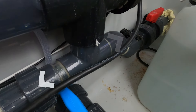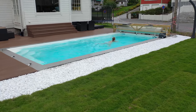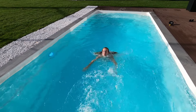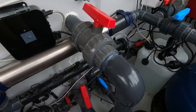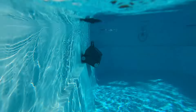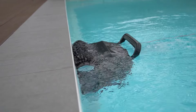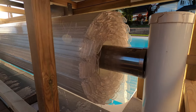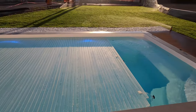After the water is treated, it is split into right and left sides — the right side goes to the discharge nozzles and the left side goes to the waterfalls integrated into the pool cover bench. Besides the main system, there is a smaller circuit dedicated to the water jet, also known as the counter current. When triggered by a pneumatic button from inside the pool, the jet pump turns on and water is sucked in from the bottom pipe and pushed back into the pool through the upper pipe. For debris that doesn't end up in the skimmer, we have an 8Stream 7310 robot vacuumer that sucks up debris from the bottom and walls and even brushes the waterline. The only part not controlled from the tech box is the control box for the automatic polycarbonate slat cover, which can be controlled via the box, remote control, or auxiliary relay on the Aqua Xenic.